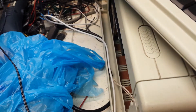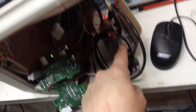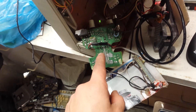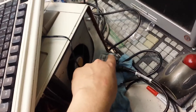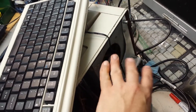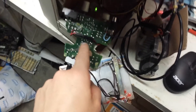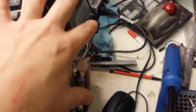My amplifier sounded really, really bad. I figured out what the problem is. Apparently, by having both the amplifier and the Raspberry Pi powered off of the same power supply, it was causing feedback. I'm going to put in the transformer for the amplifier. I'll still have one switch that'll turn on the power, and then I'll split off where AC will go into that transformer — that will deliver power to the amplifier — and the power supply here will deliver power to everything else.